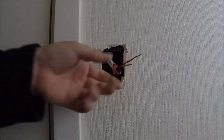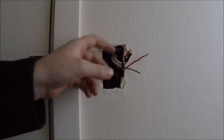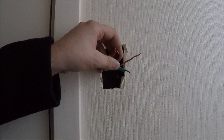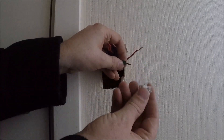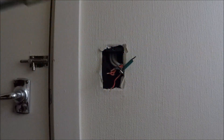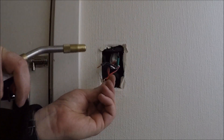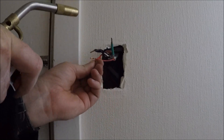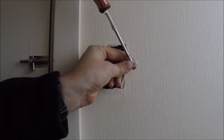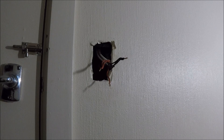So what I'm going to do with these earths first — they're twisted up and they've got solder on them, I don't know why. I'll put a bit of heat shrink over it — they've always got sleeving on them which is perfectly fine to leave — but because I've got some on hand I'll throw it on anyway, then throw a connector on the end. Burn it down a little bit — careful not to burn the walls. Definitely, if you come across earths and they haven't got any sleeving on them, you need to put some insulation over them.